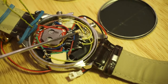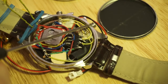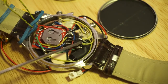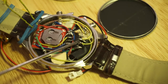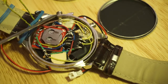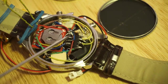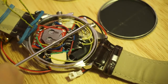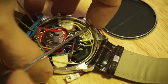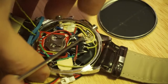That leaves just two more pins on the ATtiny85 for the buttons. I used to have the buttons grounded — with a pull-up resistor on pins 4 and 5 of the ATtiny85, these buttons would ground those pins via the case. But in the earlier version when I was trying this out, it didn't work that reliably because I don't think these buttons were ever meant to work at all. They move very — just barely a millimeter or so.